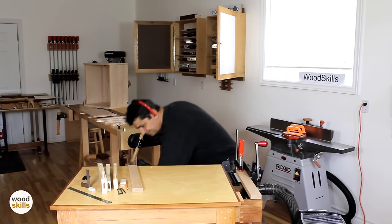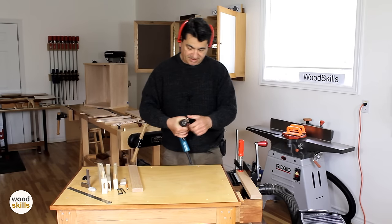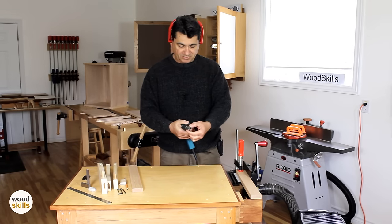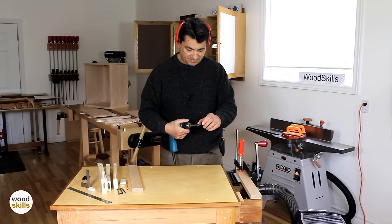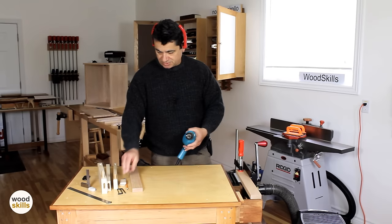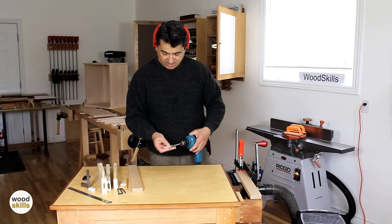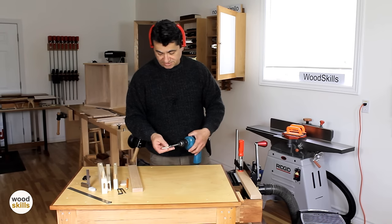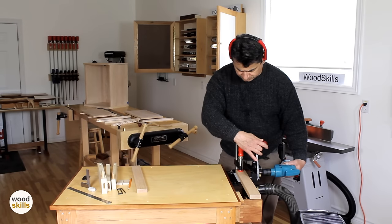And this is the drill I use. I don't use a cordless drill, though you can. And this is the end mill with a stop collar. Oh, this is already preset to the depth of 1 inch, which is half the length of the actual loose tenon. So half of two is one. So an inch on either of the frame members.